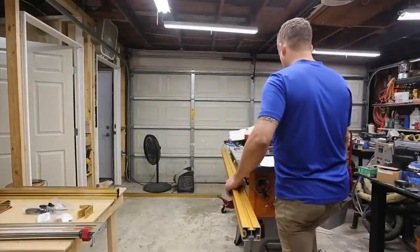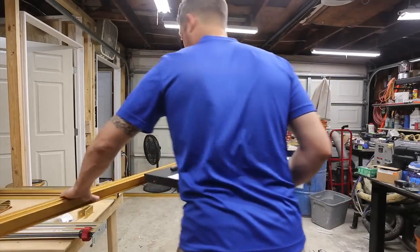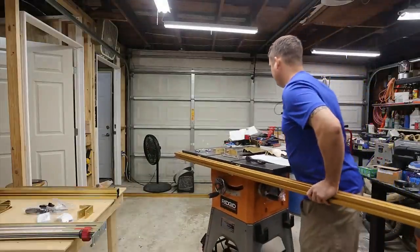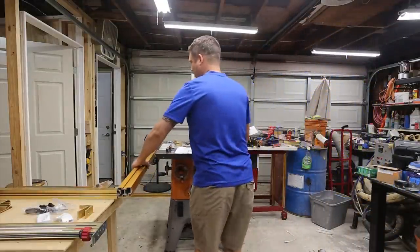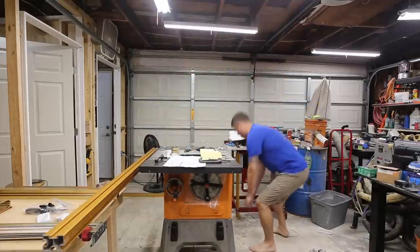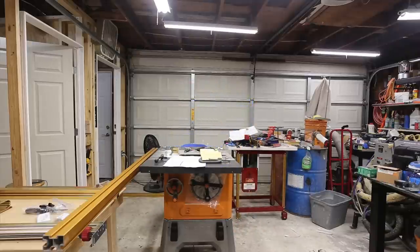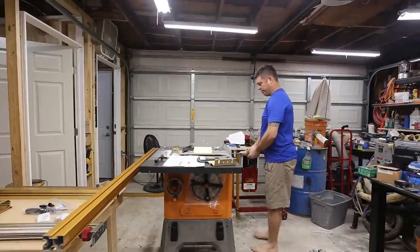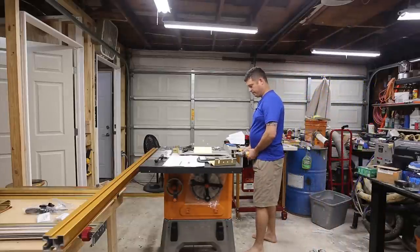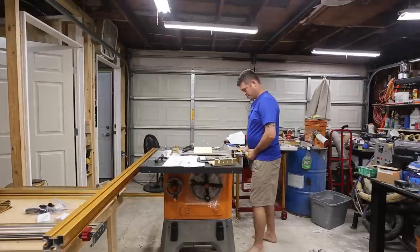And this would be a nightmare if I didn't have casters built into my saw, but because I have casters built in, this is relatively easy to move around. And that's the whole reason that I did this. That drop is just a little harsh. Okay, so this is cast iron, and it generally drills really smoothly. But you want to drill it slowly.